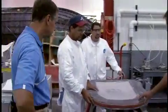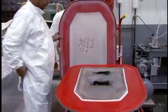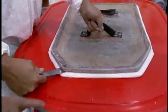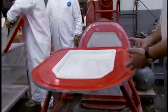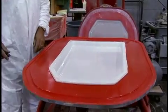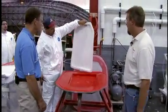Here's another compression part — this is the actual 350 chain lid. Let me show you how you demold a part. You can see the lip here where the seal would sit to seal it off, and the outer part is where the vacuum is pulled that actually forces the bag down. And here is the finished part — go ahead and take it out. Wow, look at that. That is beautiful. Part's ready to go.